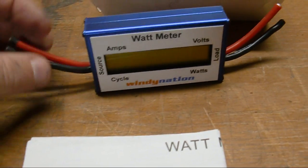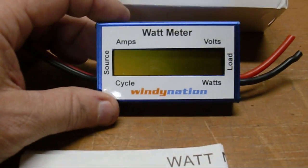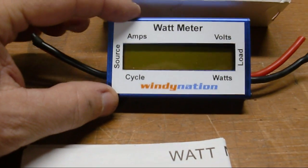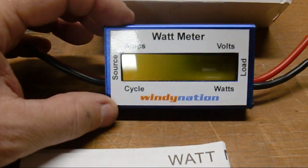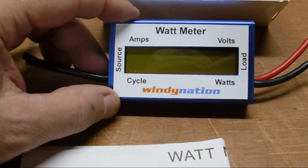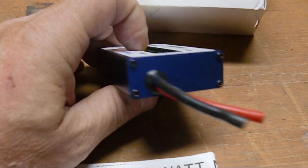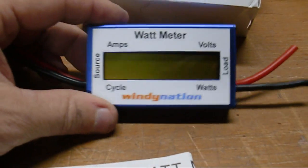It's good from zero to 60 volts — you don't want to exceed that. It's good for up to 50 amps continuous, which is kind of pushing it. It obviously has a little shunt inside, and you put 50 amps through anything and it's going to get warm, so you probably don't want to be using this too often at the high end. Go beyond 60 volts and it's probably going to fry. But what's nice is it's an all-metal case, uses some pretty high-quality stranded wires, and it's made in the USA.